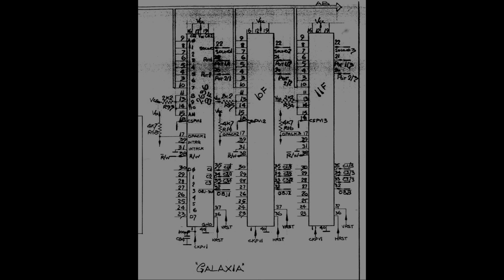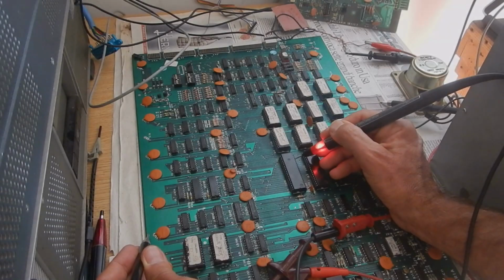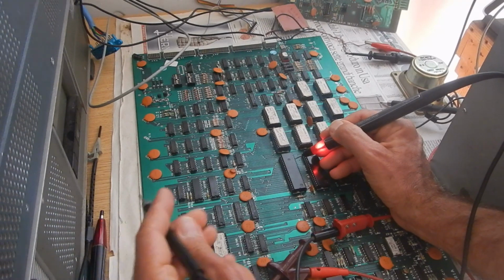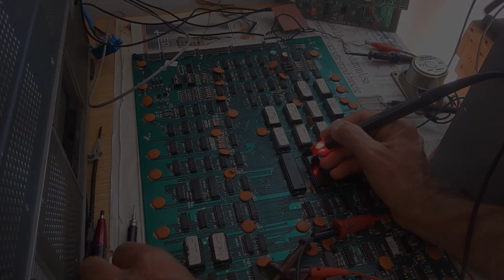The reason for the solid white screen could be because the CPU is unable to address any of the 2636 integrated circuits. So that's what I'll try to check now. This select line is definitely not toggling when I reset the CPU.